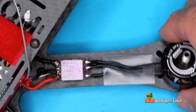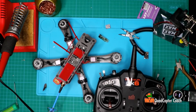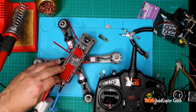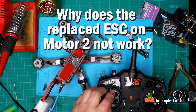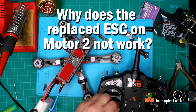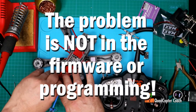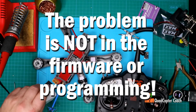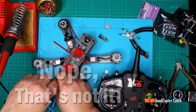With that, the next thing I want to do is just test that and make sure it's working. Let's bring out our radio. I should probably do this connected to BLHeli Suite, but I'm going to connect the battery and just go with the radio. I saw a twitch there. Let's go arm the motors. That may just need some programming in BLHeli Suite because we're not getting anywhere. Let's check something — maybe it's because the firmware is off. Let's unplug that again and see if that twitches.